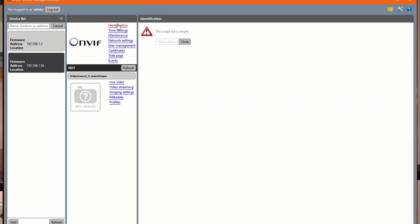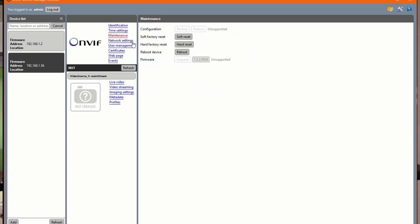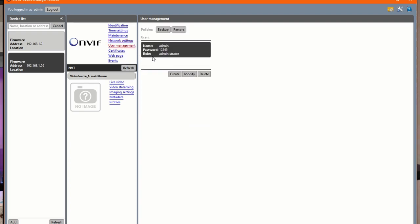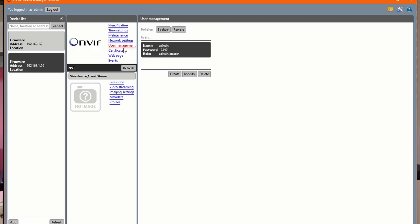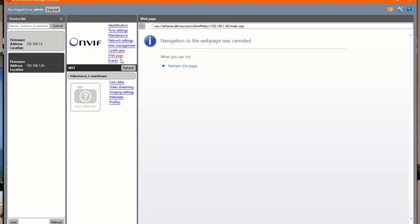What about the ONVIF integration? This is Geek Toolkit, and I come here to bring you a technical view. We're going to load up ONVIF Device Manager and verify the ONVIF compatibility of this camera. What you see immediately is this camera starts falling over very quickly. There are a number of things that are not implemented, a number of errors, and it just really doesn't look right. You can tell right away that something's not right with their ONVIF integration. I would not consider this ONVIF supported — I consider it very baseline in that it can be detected, but that's about it.